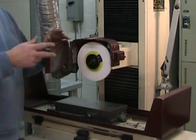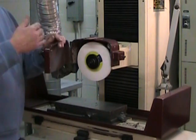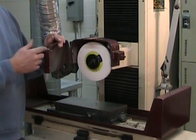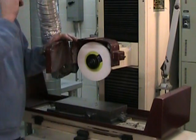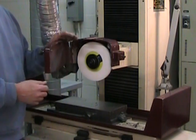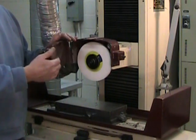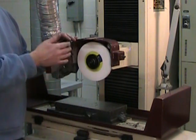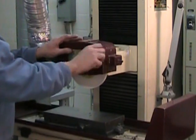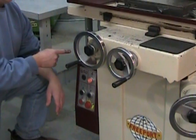We're now ready to start the grinding wheel for the first time, but be careful — it hasn't been balanced yet. We're going to start by cycling it: by playing with the on/off switch we start, stop, start, stop and progressively bring it up to maximum RPM. Usually on a small grinding wheel such as this — a 10-inch by half-inch thick wheel — we don't need to pre-balance it. But if we were using a larger wheel, say a 12-inch diameter one-inch-thick wheel, we'd have to rough balance it before installing it on the machine. In this case that won't be necessary. We start the spindle by cycling the switches.